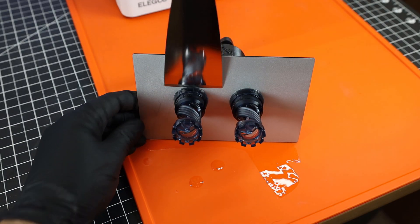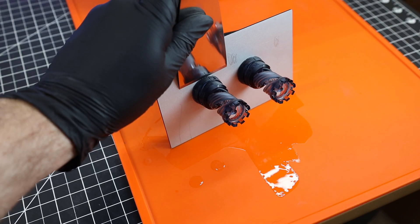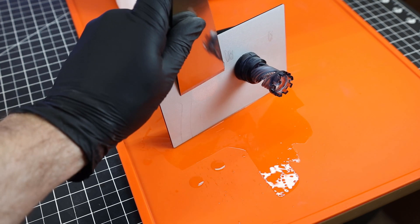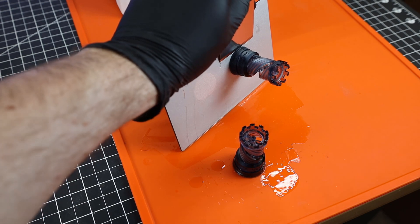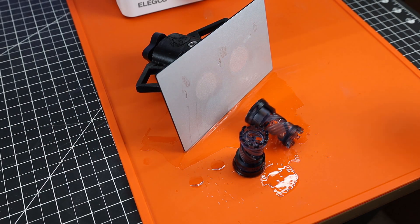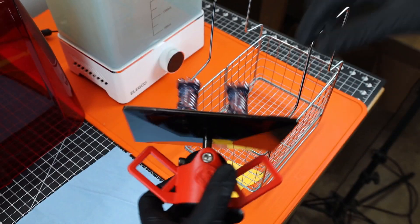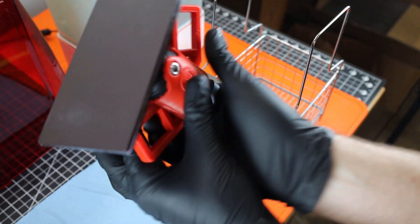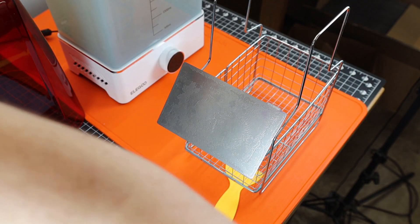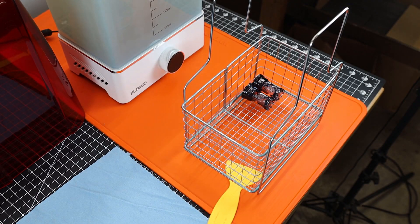With them clean, I need to get them off the build plate using a sharpened metal scraper and a rawhide hammer. The downsides are scratching the build plate a little, eventually knocking it out of level, and smaller parts tend to go flying when they come off. This is the reason I like the magnetic build surfaces. Here's an example — I installed the magnetic build plate, reprinted the parts using the same file, and all I need to do is remove the spring steel sheet, put the build plate back on the machine, then flex the sheet and everything falls off into the cleaning basket. That's probably the quickest way to show why I like these so much.